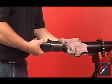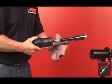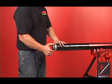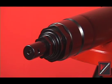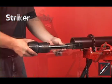Remove and clean the rear assembly. And finally, slide out the striker. Be careful not to damage the internal body threads. There are three major components to all Hammerhead Mole piercing tools: the body assembly, striker, and rear assembly.